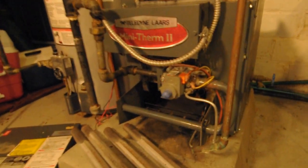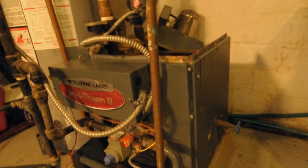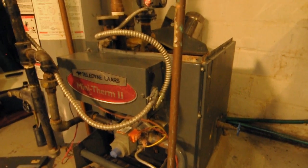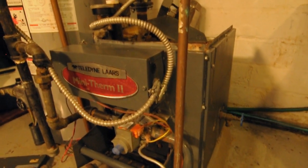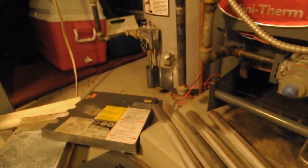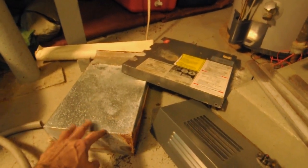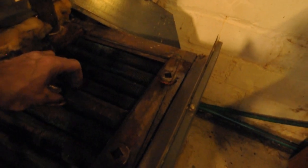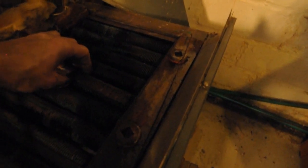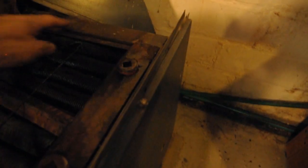To clean this unit, you're going to need to unbutton the top. It uses a set of sheet metal screws — in this case, 8 millimeter or 5/16ths. Take the top cap off. Once you do that, you'll find a sheet of insulation — remove that. Then you'll find a secondary top that covers the combustion. In there you'll find a series of caps which help control the flames coming up and direct the heat onto the heat exchangers. There was a wire coming across here that held the caps in register, so you take that out. They hook in on either side.